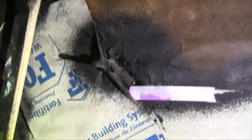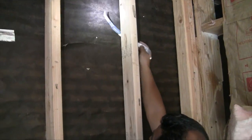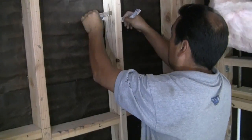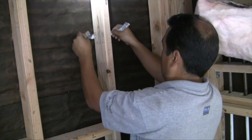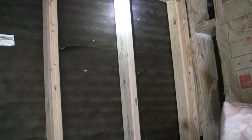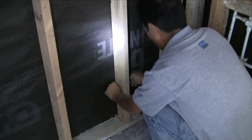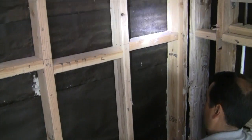This is why it's dangerous to just jam fasteners through stucco without being careful. The concern here is wood decay in this room. There was so much water intrusion that the framing decayed, so they tore the old framing out and put in new framing. The problem is that the stucco and lath fasteners are not attached to the new framing. What that means is that if the lath is not attached to the framing, that entire field of stucco on the outside could just fall off in a big wind or earthquake.